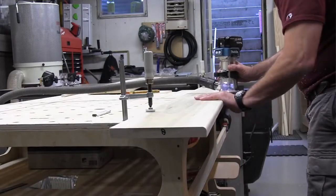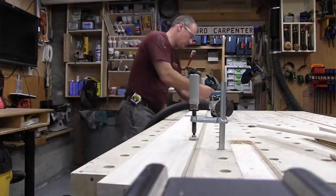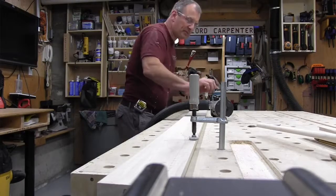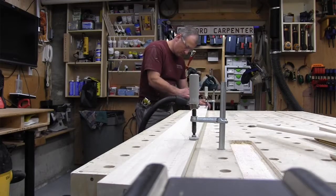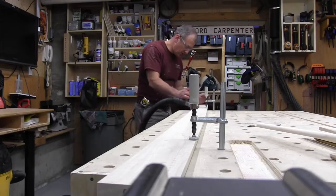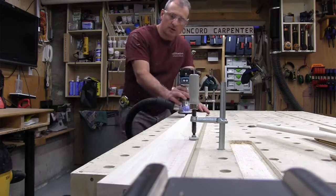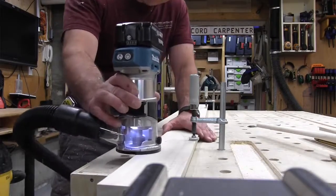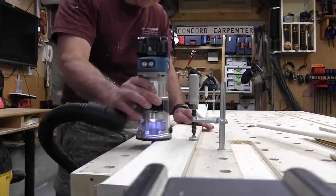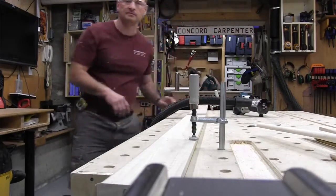For my testing procedure, I wanted to simulate a real-life carpentry application. I chose the window sill application, using a three-eighths roundover bit to route both sides of a board's edge and the ends. I used eight-foot poplar boards, routed eight lineal feet at a time — equating to four feet of window sill, both edges. My feed rate was approximately five seconds per foot. To rest the tool, I would unclamp, flip the board, clamp it, and repeat four times, then rest the tool for 10 minutes before repeating until the battery died.